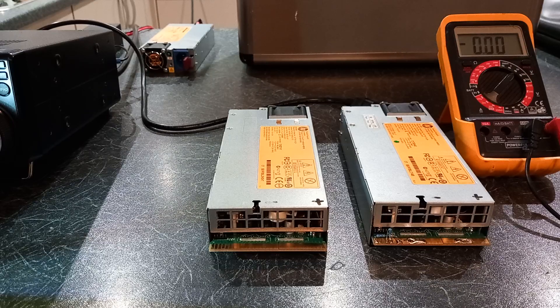You really have to be abusing one of these to get them warm. You can also series or parallel power supplies — I haven't done it, I don't need to — but you can get incredible voltage and current combinations giving immense power in watts. The radio-controlled fraternity love them as very high-speed chargers for their LiPo cells.